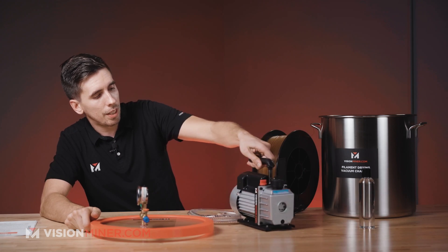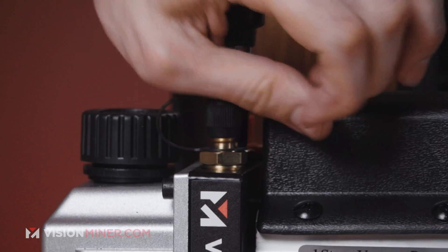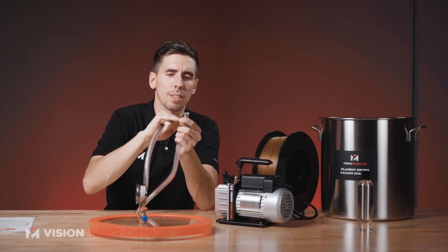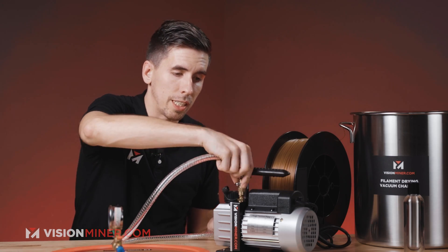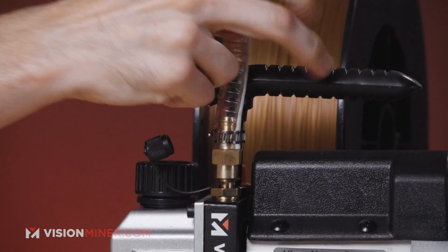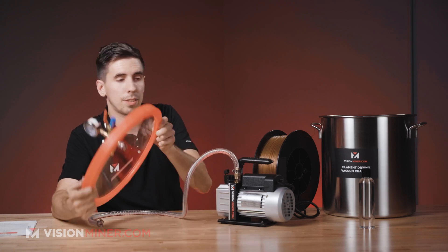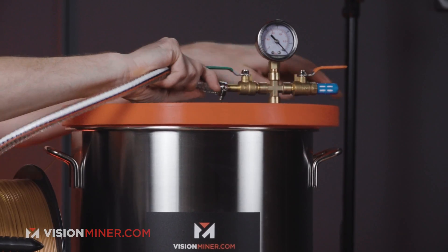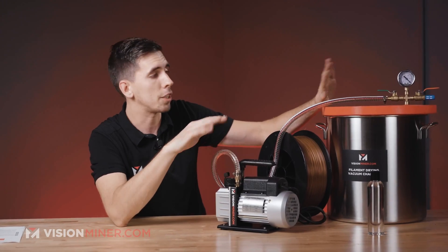Next, take the vacuum pump. You'll notice a little plastic cap over the vacuum valve — unscrew that. The hose comes with two ends: one side has a little metal fitting you won't really ever have to tighten, and the other side has a brass fitting. Screw that onto the top of the pump. Now all we've got to do is put the lid on and cinch it up against the chamber. You don't even have to get it all the way on — when you turn the vacuum pump on, that'll pull a vacuum and you're good to go.